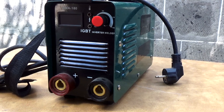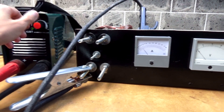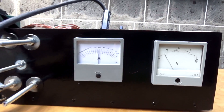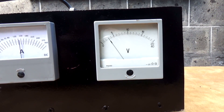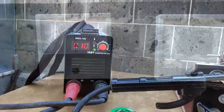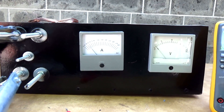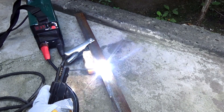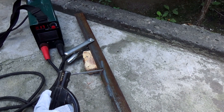The stated maximum current of this inverter is 180 A, but in fact it gives no more than 150 A. If you load more, the output voltage falls below 15 volts. We can tune it and even calibrate the indicator — complete refinement will be covered in a separate video. The minimum output current is 39 A. Despite such an impressive current, the arc ignites with difficulty, and I must solve this drawback to provide shorter and easier arc ignition.